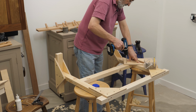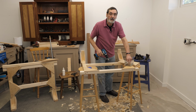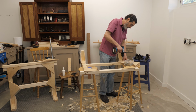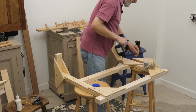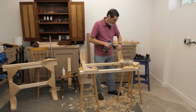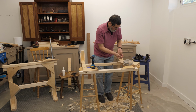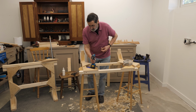Actually, if you just did this on one side, it would be strong enough for most work. You wouldn't really have a problem. It's plenty strong enough. But I'm going to suggest you put it on both sides because it equals out the pressure on the joint line, which is what we're engineering. Imagine, this isn't a whole lot different than how they put aeroplanes together at one time. So goes along here. All the gussets are the same size.